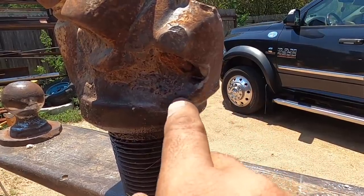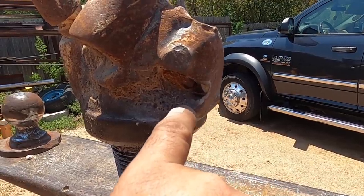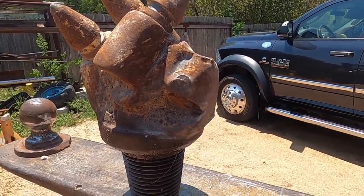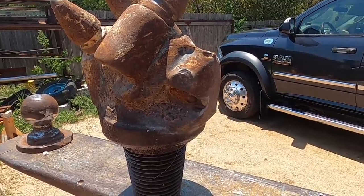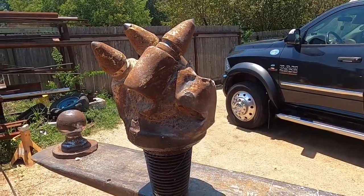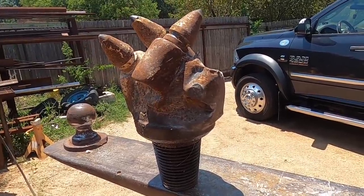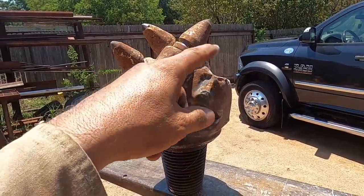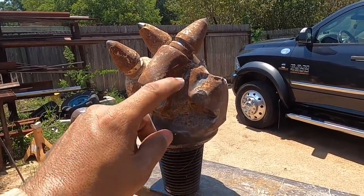That way, if I do hit any impurities like dirt or mud or even a space, it will still continue cutting all the way through. I'll follow it all the way around this way. And normally I can get them off in one shot. Of course, it's more so because of the oxygen pressure and a real clean tip. And then putting it back on, it takes just a little experience. You kind of see where this one is compared to this one. Maybe you can measure it out, or whatever you do, you'll figure it out. Each one of them is slightly different from different manufacturers. And so I'll put a tooth in the new pocket, angle it the same, tack it all up, and then weld it up, clean this all up.